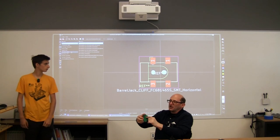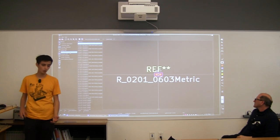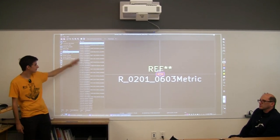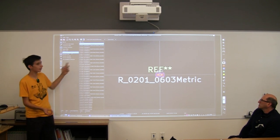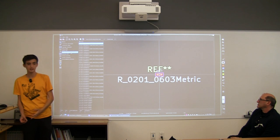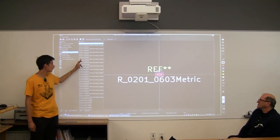And surface mount are like these transistors here. They're on the surface of the circuit board and just soldered to the board. So for this specific board, we're going to want a component that just lies on the surface. And that we can find in here. Okay, there's different sizes now. I'm not going to explain the sizes, but the smaller the number, the smaller the part. On your motherboard, on a Raspberry Pi, you're going to be using super, super small components because a human's not placing them, a machine is, so it's super precise. But for us mortal humans, we have to deal with hand-eye coordination. And so that's why we give ourselves some room and use what's called an 0805.